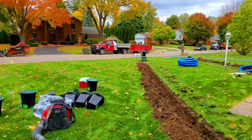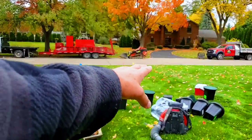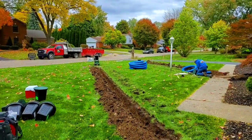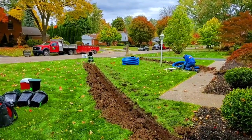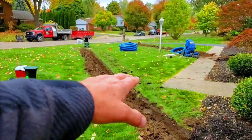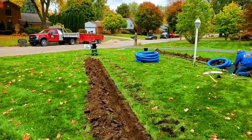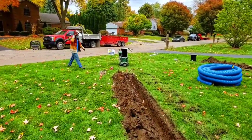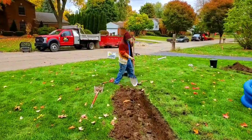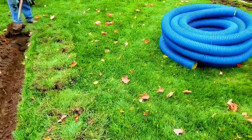See which direction. You can measure this curb, and then you can measure this curb, and I did, and we got 12 inches of drop. So we want to take these on an angle towards this side of the lot. That way we get more slope. You're not trying to run water uphill, which we all know how that works out. So the guys are doing a very good job. They're doing a beautiful job.